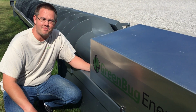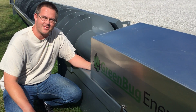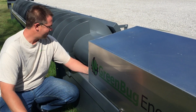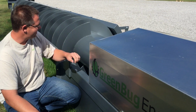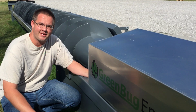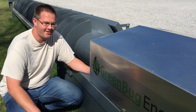This unit is a permanent magnet generator. It's going to be connected to an inverter system that'll be charging batteries for this off-grid home. The unit will turn at 40 RPM. It takes 150 liters a second of water, and it'll be installed at a 26 degree angle.